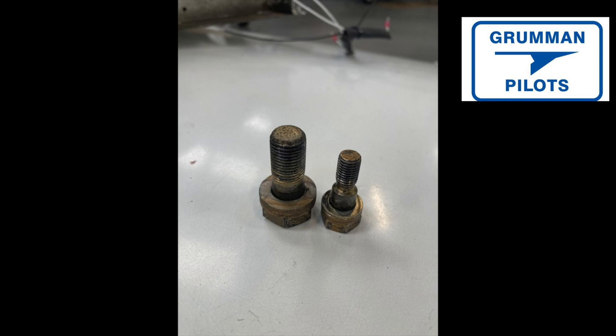You can see the one on the right is the proper size shoulder bolt. What on the left is not an AN6 — that bolt looks like an AN8 or bigger, so it's way too large for the job. It's probably not getting a tight capture. Now let's take a look inside the spar and see how they made it all work.